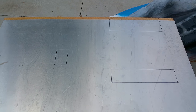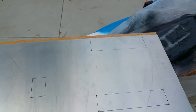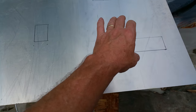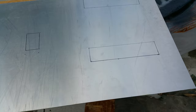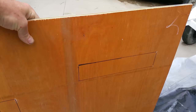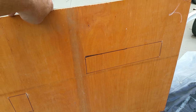I've got my layout on the panel. The top section I'll cut out with the table saw. For the smaller sections I've drilled tiny holes through the corners - I'll cut part of this with the table saw, but whatever I can't cut from the front I'll saber saw out from the rear.